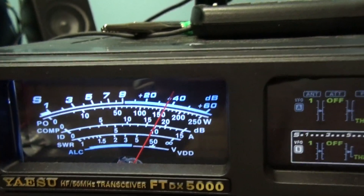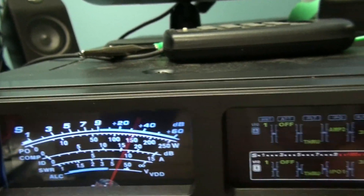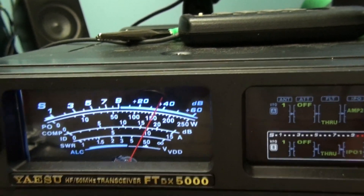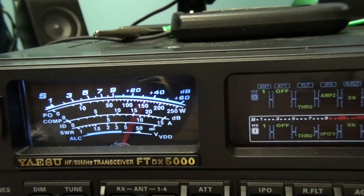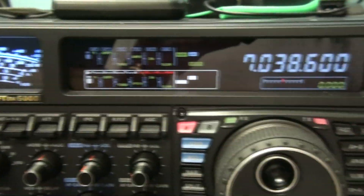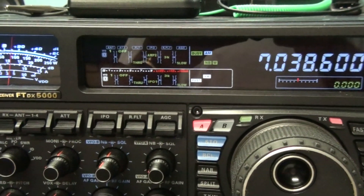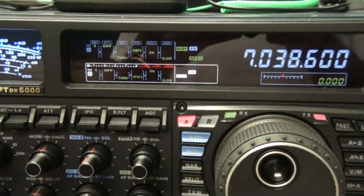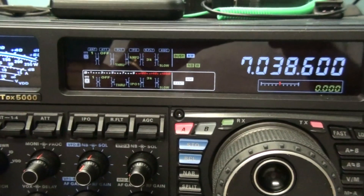On 160 metres with the tuner off, you can actually still hear the interference. I'll pause the video, go up on the roof, and install the choke at the feed point to see how that goes.